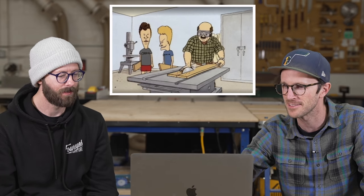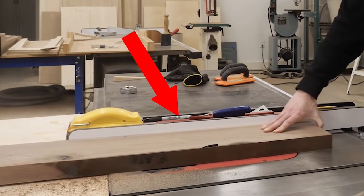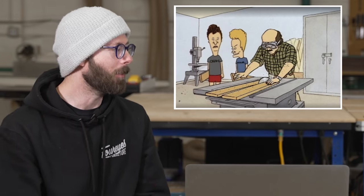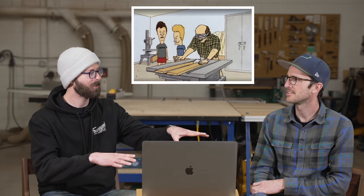So that's his first problem. And then watch his hands. Let's just pause it there and talk about that part. The fence doesn't exist, which is a very integral part to a table saw for a rip cut. It looks like something jammed into the miter slot. He was just freehand pushing it through, which you would never do.